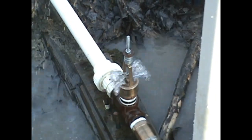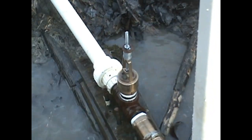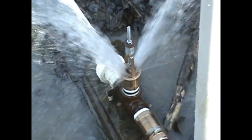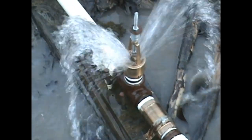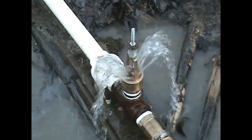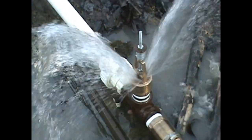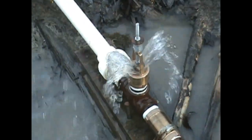Let's have a look at the valve changes — zoomed in a bit closer. I basically drilled out the top guard and got a piece of 5/16th threaded rod and used a nut. I couldn't find a hex union locally, so I threaded the two rod pieces together and ran that threaded rod through the hole I bored out on top. I put some washers on for weights — I can add and remove different weights to change how the pump operates and how much water volume it uses. This will let us adjust down to pretty low water levels in the summertime.